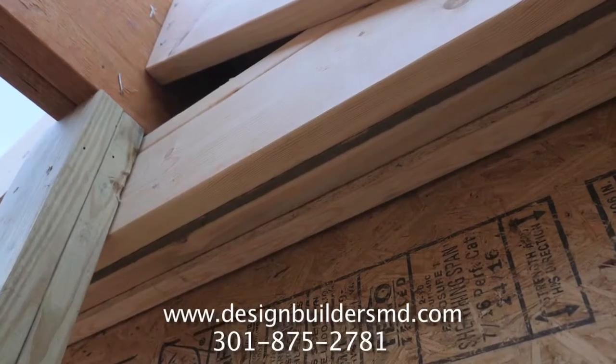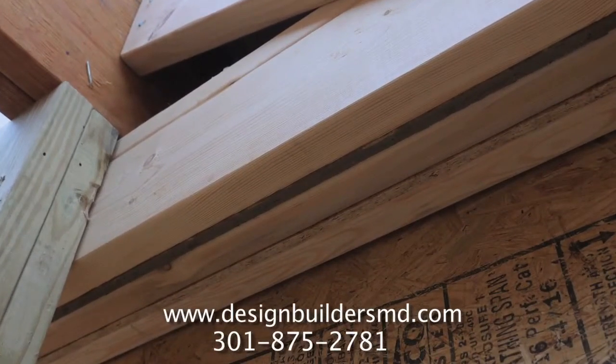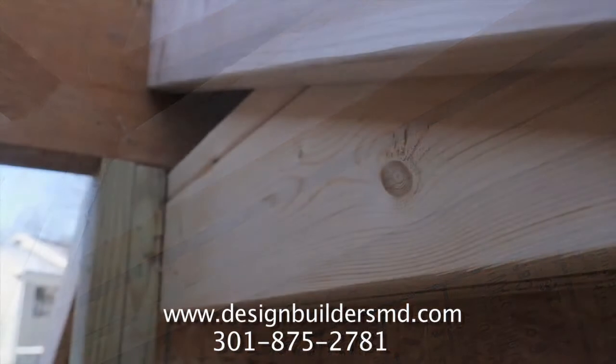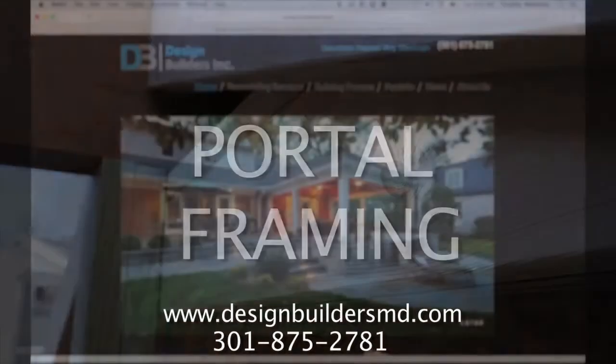Headers are small beams, typically double or triple 2x6, that go above a window or door units. Headers transfer the roof load around the windows and doors so that they don't have problems when used. Headers are used in non-portal framing situations.